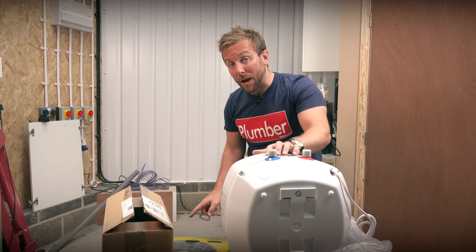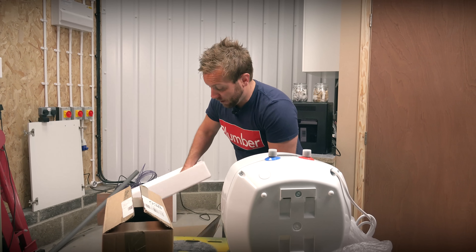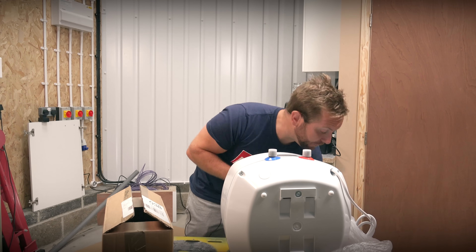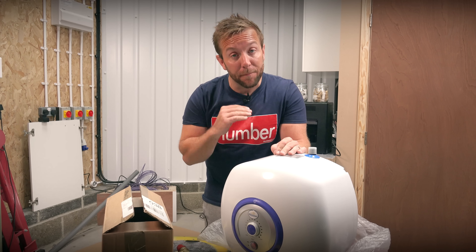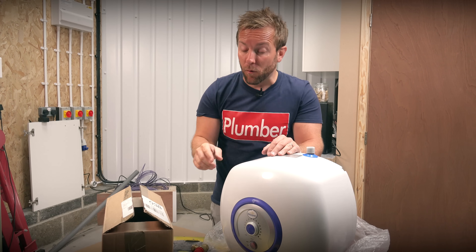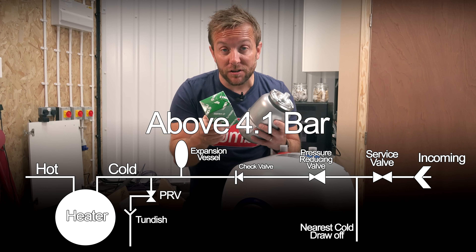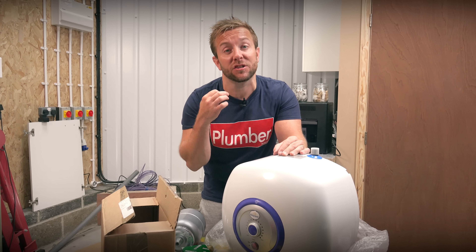When you put that box down, make sure you check underneath it. If you lift up the last bit of polystyrene you'll find the wall bracket and also the high pressure relief valve. There are two types of kit: the mains pressure kit is rated up to 4.1 bar incoming and includes just the high pressure relief valve. If your system is above 4.1 bar, you'll get a two-litre expansion vessel, a pressure reducing valve, and a check valve — that's a non-return valve in normal parlance.